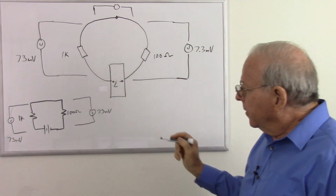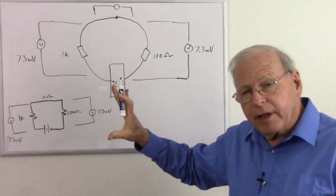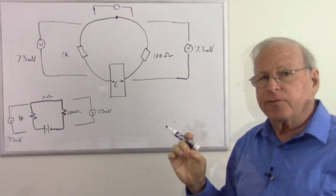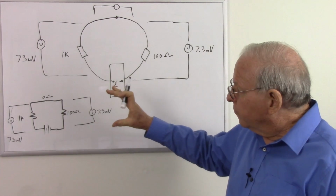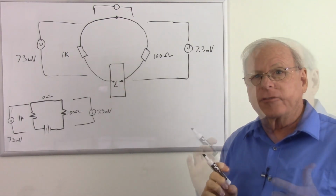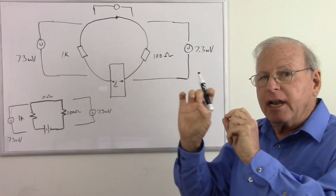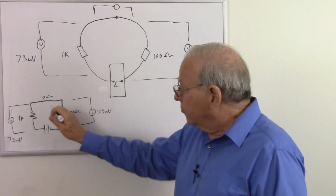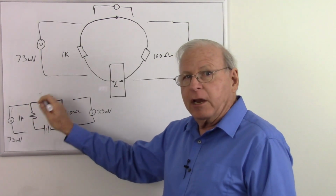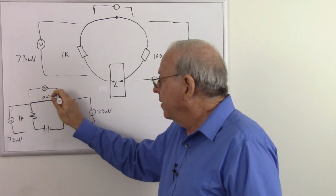What are we going to expect there? Well, we have how much resistance? 0 ohms. Now, important thing here, and this comes up later: Ohm's law cannot be applied to the seat of electromotive force. In other words, you can't apply Ohm's law where electromotive force is being created, which is right here or here in this case. At least it appears to only be there in this case. So Ohm's law applies when we take an external voltage and apply it to a circuit, not to a circuit that's creating its own voltage. So is this creating its own voltage out here? Well, in this circuit, the only EMF is inside the battery. So there is no voltage being created there. It's 0 ohms. And so we expect a voltmeter to read 0 volts.